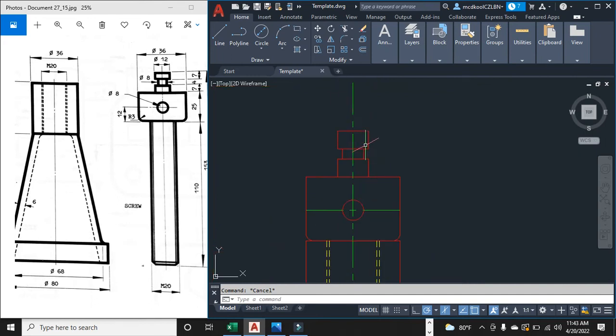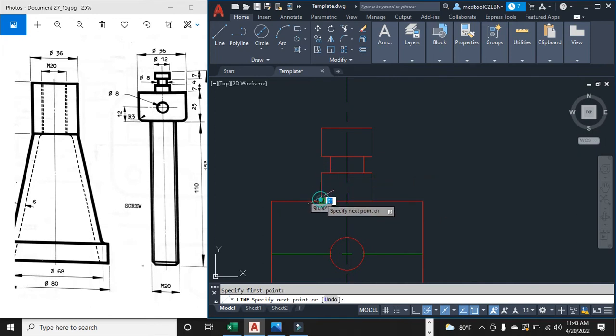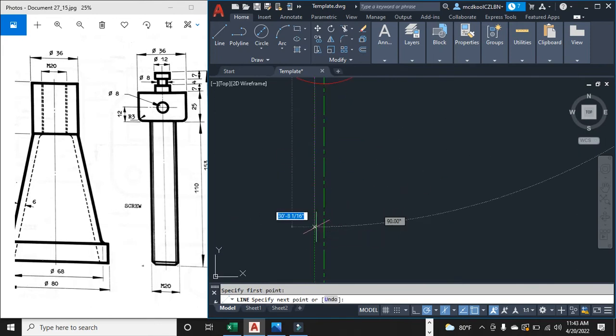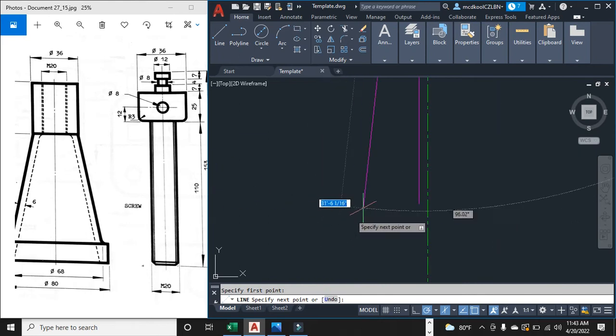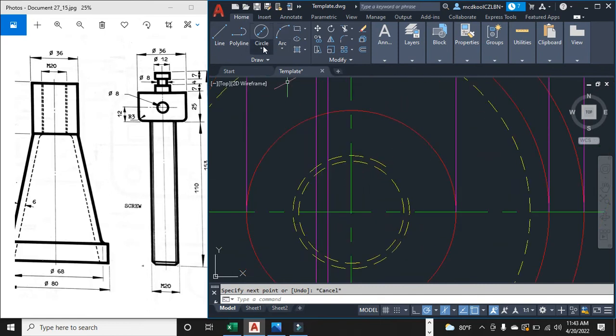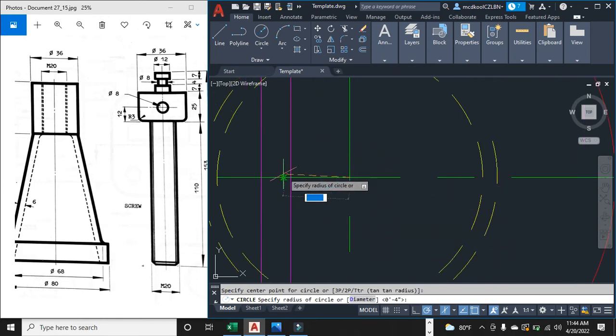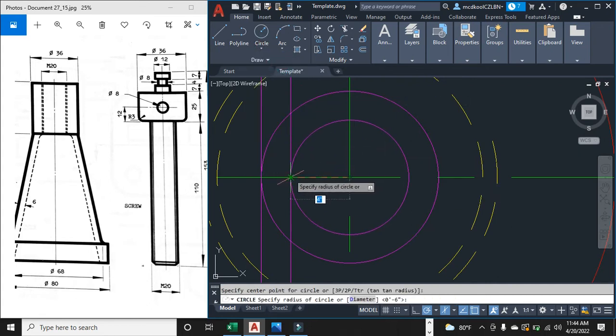And this part in the plan view, we'll see these little circles here in the plan view. Get into the habit of projecting from one view to the other. So that is the 8 circle, well, the 12 circle, sorry. And then we're going to have now the 8 circle here. And these holes are at the top of the figure. So the big one is going to be solid. Well, that small one is going to be hidden.